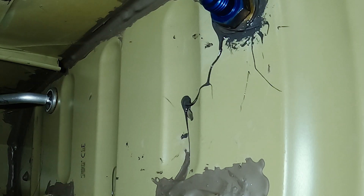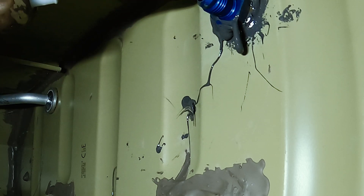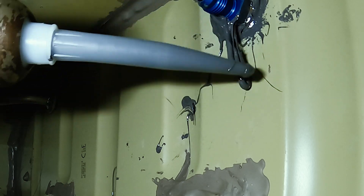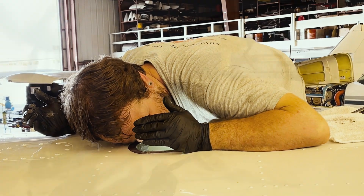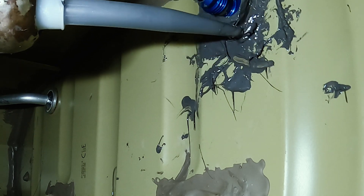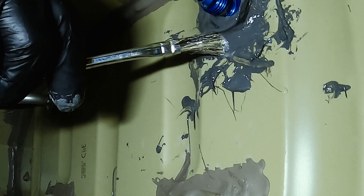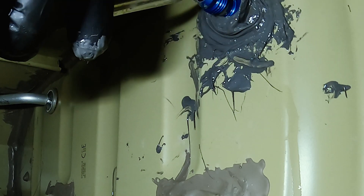Tightening that down finger tight, then applying chem sealant by finger — first a bead of it, then pushing it around with his finger, finishing off with a brush coat to really make sure it is sealed, because no one likes fuel leaks. There it is, getting all smooshed up. Of course, wear gloves because this stuff sticks to everything and it's disgusting. Checking it out, seeing how it looks — this is the view from the iPhone, all glopped on. That's inside the tank.